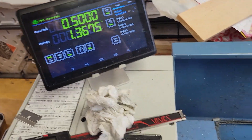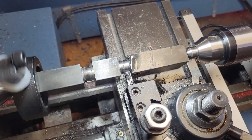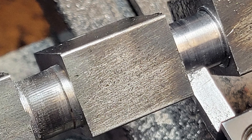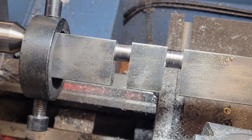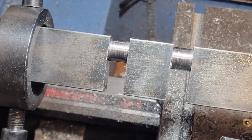The last few passes I run at about 100 RPM on the lathe — the slowest it will go. It's important to have an inside radius between the journal and the sides of the crank web; we don't want a stress riser here. Notice how I've left plenty of material in the corner during my roughing operation so I can make this nice radius. Those are some good looking crank pin journals.